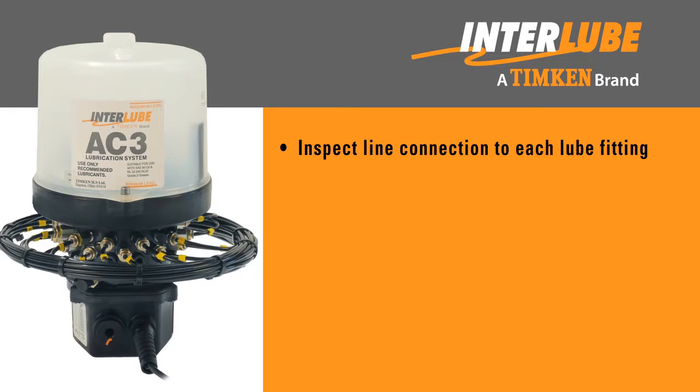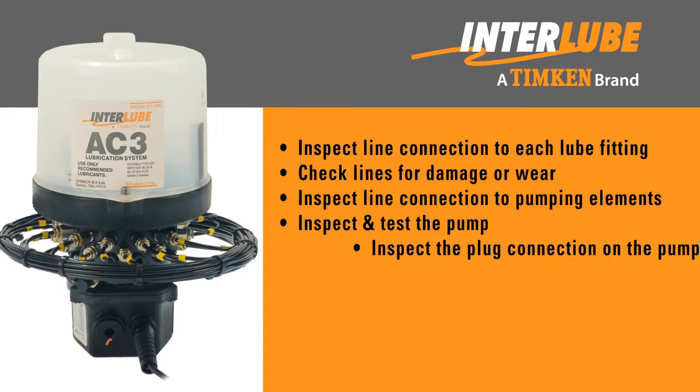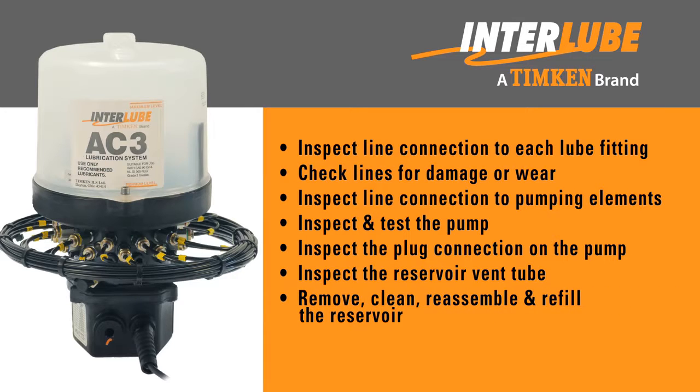To properly inspect your Interlube auto grease system, you will need to inspect the line connection to each lube fitting, check each line for any signs of damage or wear, inspect the line connection to each pumping element, inspect and test the pump, inspect the plug connection on the pump, inspect the reservoir vent tube, know how to properly remove, clean, reassemble and refill the reservoir, and replace the label if it is peeled or missing. Be sure to wear the required safety gear when performing this work.